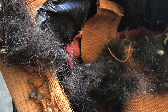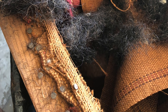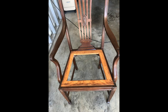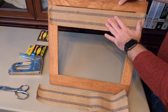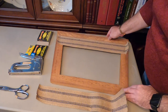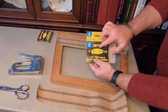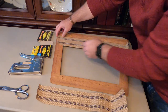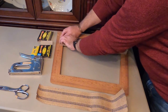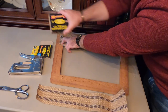It was covered with a needlepoint that was ripped, and inside the needlepoint was horsehair and a menagerie of tacks and broken things. So today we're going to put a new covering on that seat. I'm using a 3/8-inch staple to put the initial webbing down, and then when we fold this over at the end I'll go back and put a 9/16-inch staple in there.